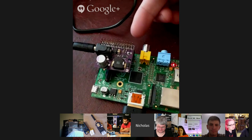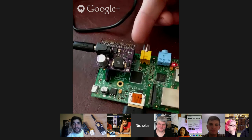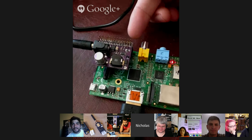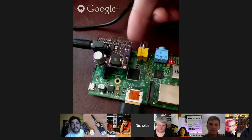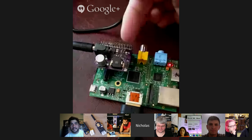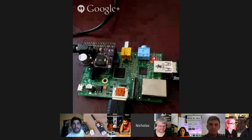I wish I could show it to you on my Raspberry Pi B+, but it hasn't come yet. But what I envision is that, right now the problem with the B+ is that if you have a 26-pin IDC cable, you can't plug that in without snipping off the pins 27 and 28. With this, of course, you could use this as an adapter as well as powering everything. Oh, I forgot. This will generate 5 volts at 2 amps, so it can power everything that you could conceivably want to hook up to a Raspberry Pi.